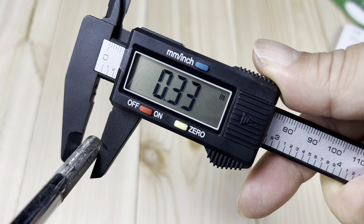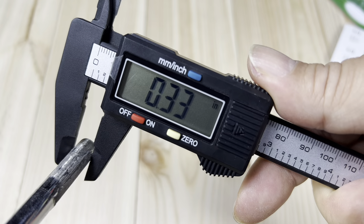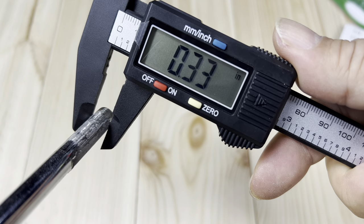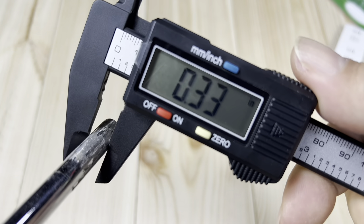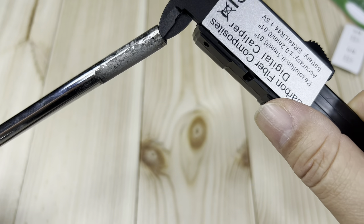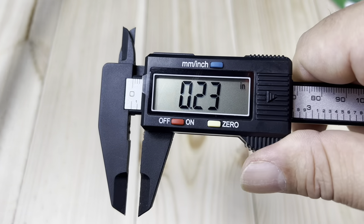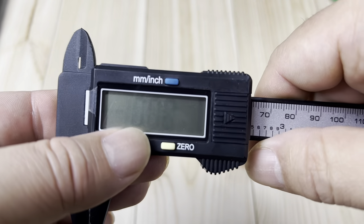I'm going to close it up on the shaft — 0.33 inches. So pretty darn close to the 0.355 I was guesstimating, because normally these are 0.370, but that did not look big enough to be 0.370. So 0.33 — what I know is this particular shaft is 0.33, which is pretty awesome. And if you want to find the inside diameter too, you put the pins on the inside and push them out — the inside diameter here is 0.24 inches. So you can find both outer and inner diameter with this.